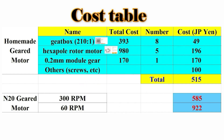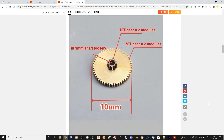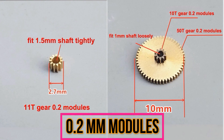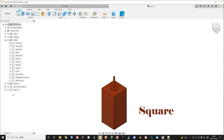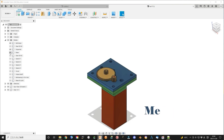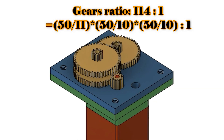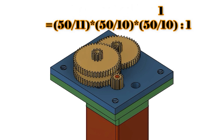It is still not so expensive. I will also use gears that have the same module — I bought them from AliExpress. The module is 0.2 mm. I designed a simple structure containing three pairs of gears, and the gear ratio is about 114 to 1.